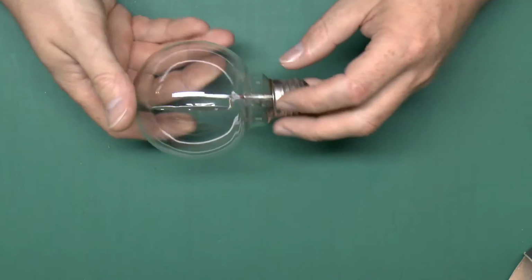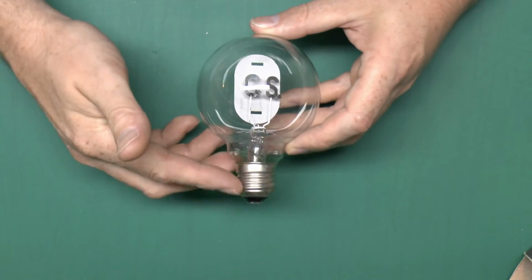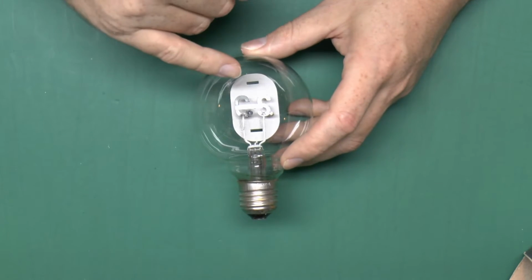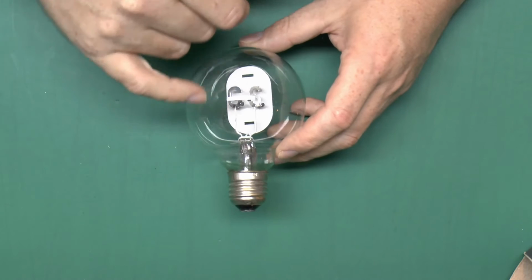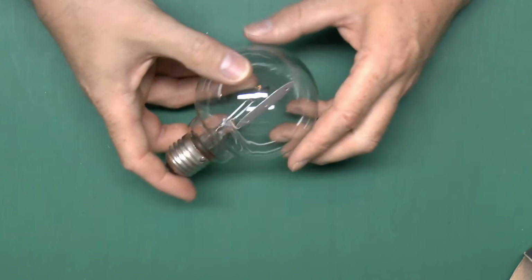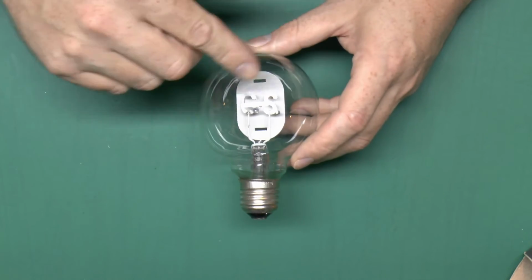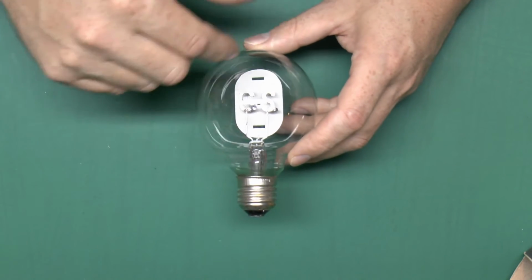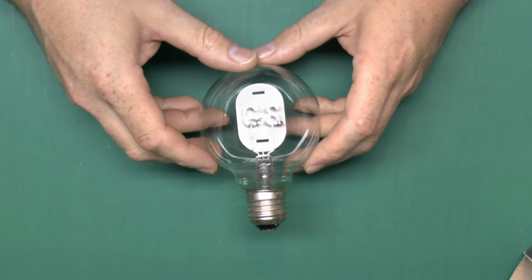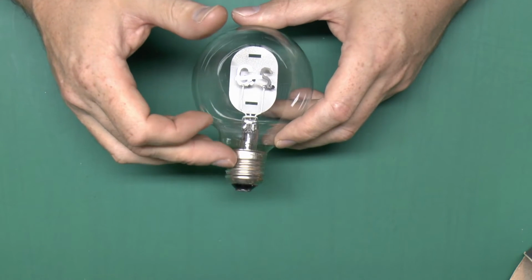Let's have a closer look at the device. It's a very standard glass enclosure, threaded Edison screw fixing there with the terminal on the bottom, and internally we've just got the letters GS here and a sort of oval shaped background piece inside. And construction wise it's quite a simple device, and these essentially are just a metal electrode, or electrodes in this case, in a glass envelope filled with either neon or a bit of neon and argon, or a Penning mixture as it's also known. And the other thing is, in the base here there will be a resistor to limit the current